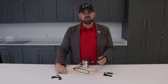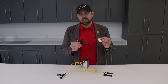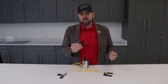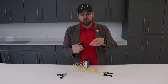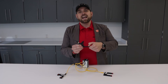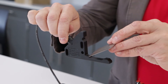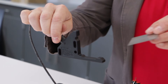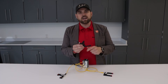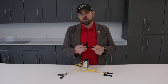The last is infrared. If you've got oil or dust or anything causing false switching in your application, the infrared can burn through it — it has that much gain. The smallest detectable part with an infrared light sensor like this is one millimeter. It's available in the traditional C frame, the L frame, as well as in this rugged version used for stamping and welding.